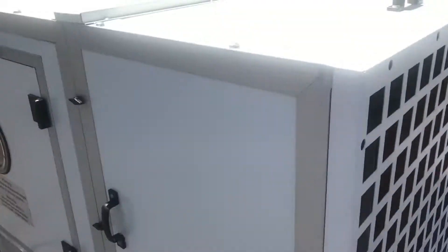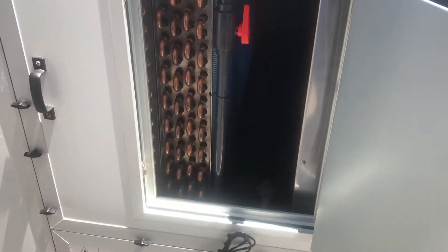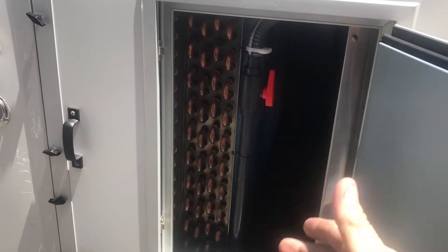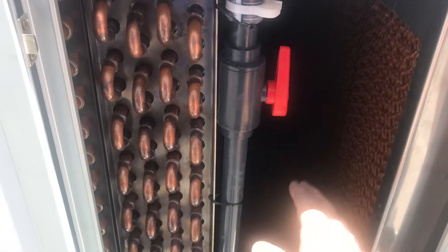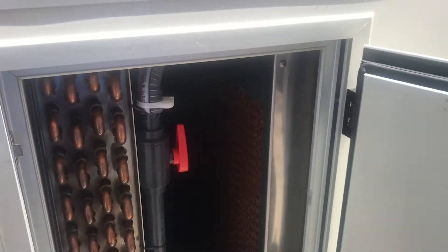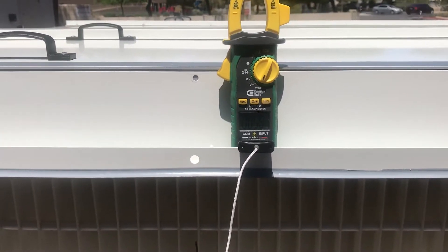It's dropping enough that it comes around over here into a coil. Here's that coil. That water, now from over there, is passed through this coil. There's no touching — none of it's touching. As that water is brought in through this coil, this temperature space where my hand is, is lowered. The water inside here is also another set of cooling, and it's passed over the top of this cell deck. Through evaporative cooling, we're able to get a 49 degree supply air temp with a 90 degree outside air.